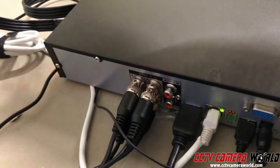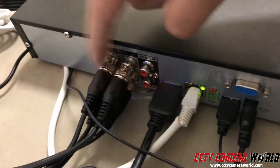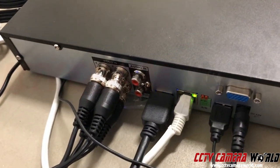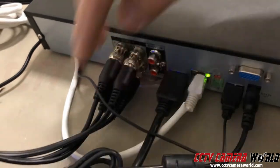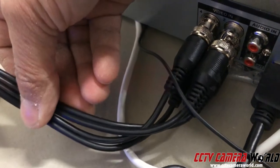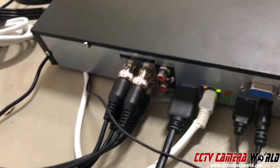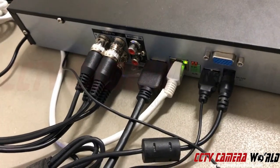Your wire may look different as to what color it is, what markings it has, but this is the connection I want you to understand. It's called a BNC, usually paired with some type of wire. Now this is a thin wire if you look at it — this is a pre-made wire. It has limitations as to what resolution it'll support at what lengths.